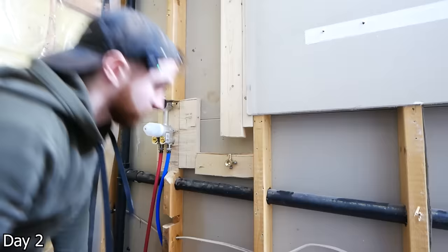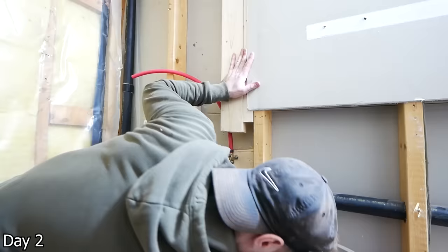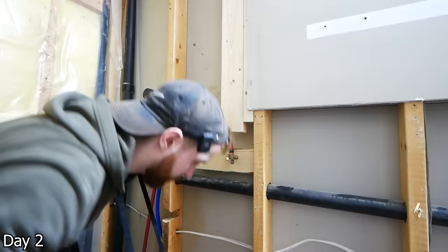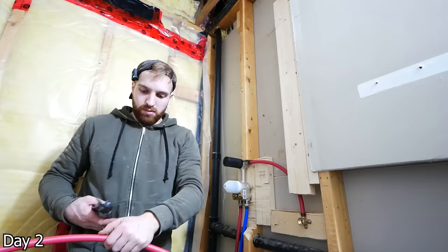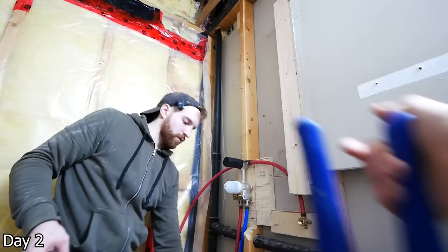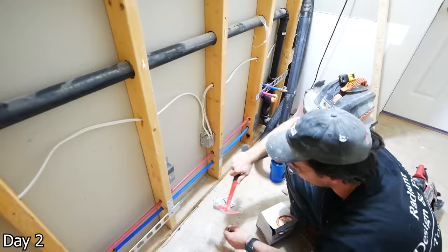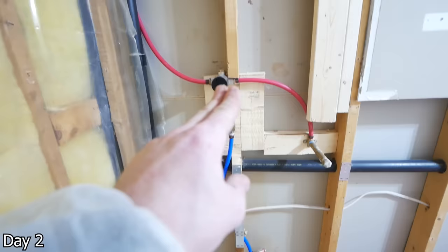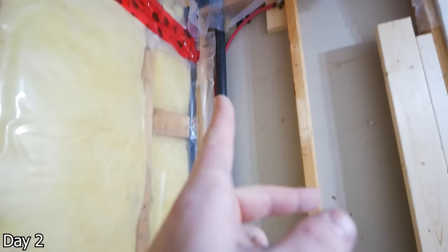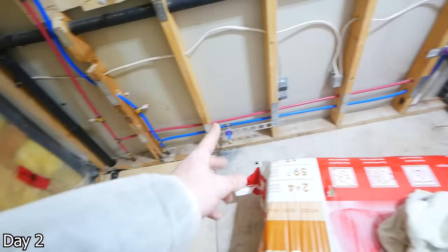With all supply lines done, we go ahead and feed the handheld and rain head. We take some PEX and crimp it onto both the shower valve and the drop ears we had installed previously. Once everything is crimped in, we also cap those drop ears — take a brass nipple, thread it into the drop ear with a half-inch end cap, so that when we pressurize the lines water won't be shooting out from those fittings. Anytime you've run water lines or drains, put protection plates over everything. Here's a look at what we did: supply lines up to the hammer arrestors, fed the valve, went down to the drop ear below the blocking, same thing at the top for the rain head with brass nipples in the drop ears, and the cold line extends out to the wall for the toilet and up to the vanity.